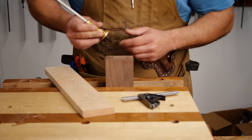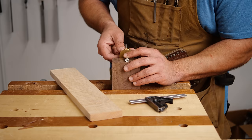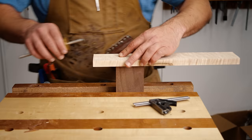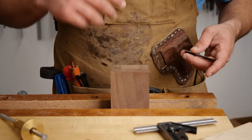I'm just going to mark that quarter inch in there. What's cool is I can then take the measurement for my tailboard — if you only have one marking gauge, you can just put it right in that line, snug it up to the board, and mark your tailboard at the same time. Do it lightly first and then a little bit stronger, and make sure those lines meet up all the way around.